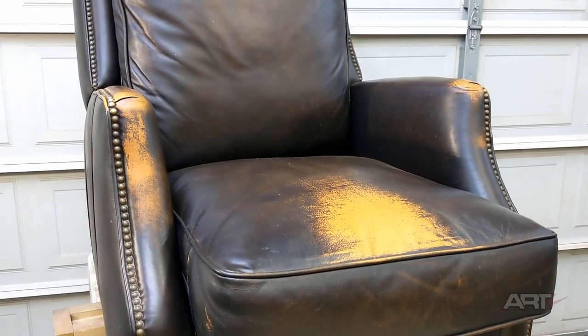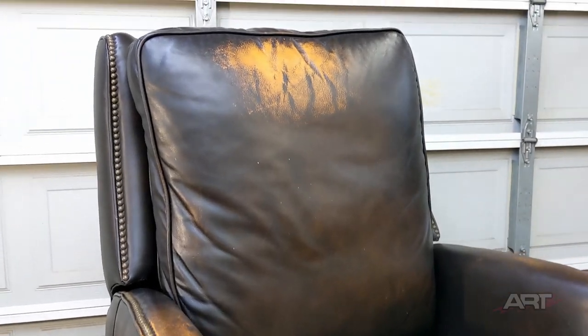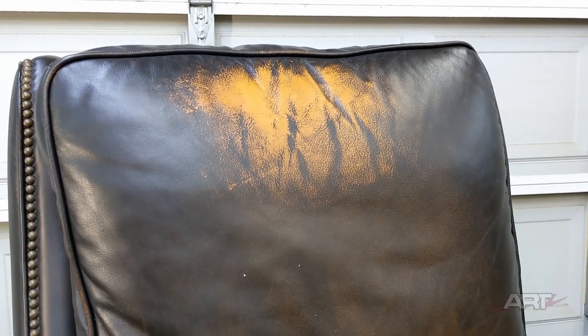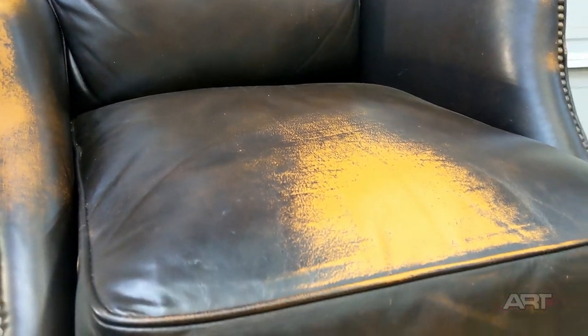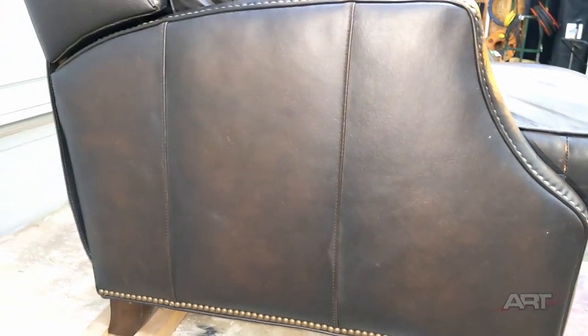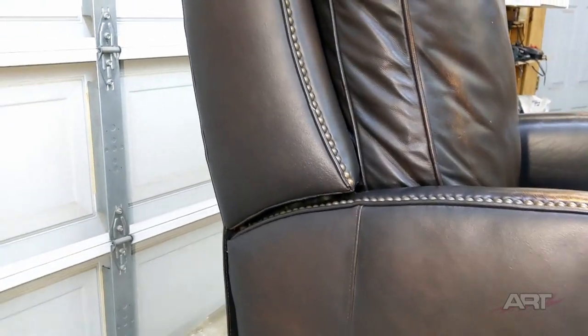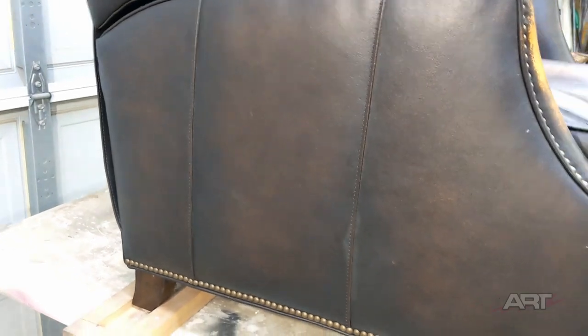It's noteworthy that the brown top coat has come off so readily. A good question is, how soft is that brown top coat? The customer wondered why all of this yellow-orange is showing down here. Well, as you can tell, the yellow-orange is supposed to show through — like on the backrest here — but it's darker around the sides. So the brown is worn off here. Looking at the sides, we can see what it's supposed to look like: a little bit of the yellow-orange is supposed to show through, but not as much as on the backrest. Here we have hardly any showing through, just a hint of it. So that's going to be our target.